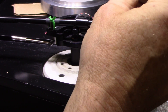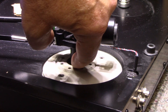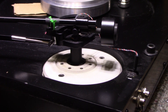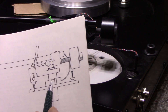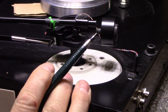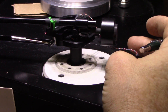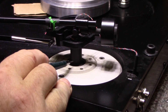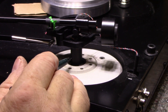There is a hole in the back end of the tonearm tube where the wires could come out, but I can see no place down here for the wires to re-enter the base. This piece here is missing. Having the wire exit at the back like this is not good because it will disrupt your anti-skating — too much pull in one direction when the arm swings.